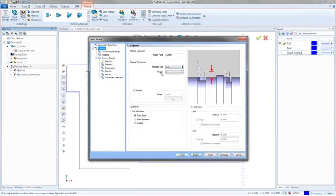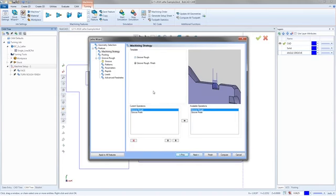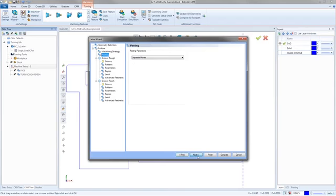Now, when we get to the next page, we have our OD, which is right. Now, down here is where we got to start thinking. We don't want this to start at the stock. If you look at the picture, it's trying to start it from way up here, but we've already removed most of that material. So I'm going to come in and say, let's go from the geometry, and then I'm not even worried about extensions. We'll do a groove rough and a finish. So it's going to give me a rough pass and a finish pass. Next, I'm not really worried about the posting.